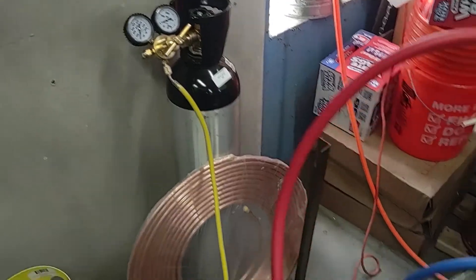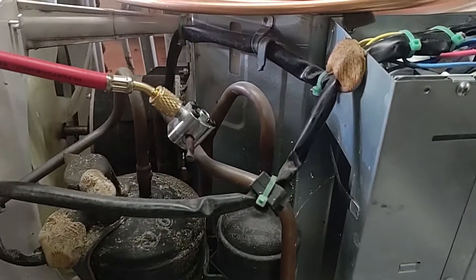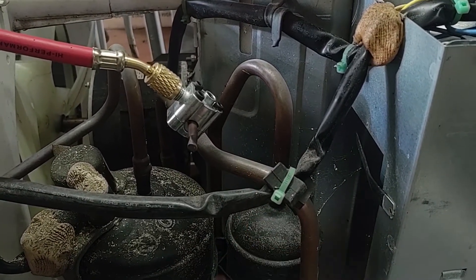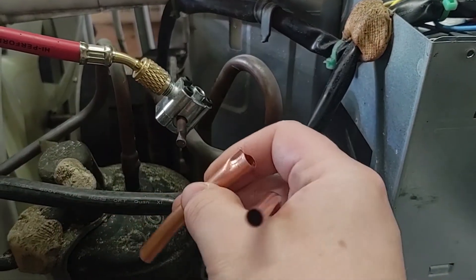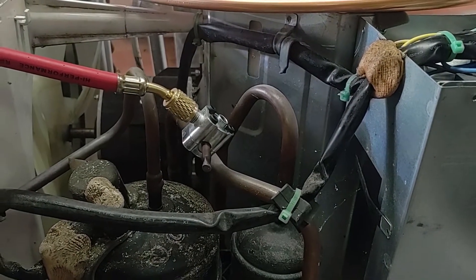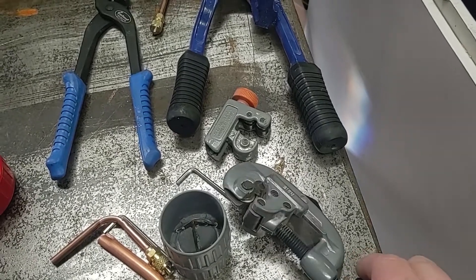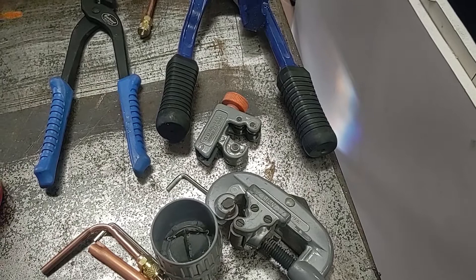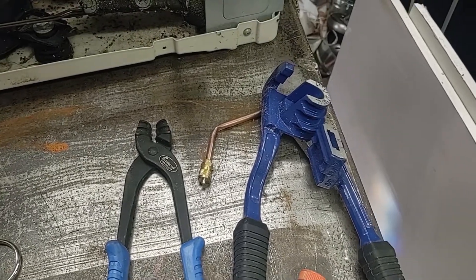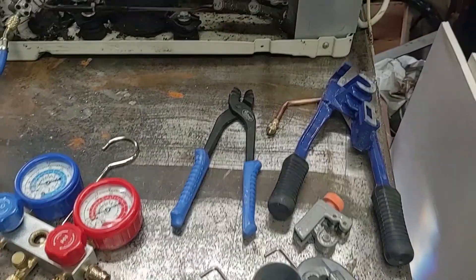I have my nitrogen tank hooked up now. I have about 20 pounds of nitrogen in the air conditioner. I'm going to take off the high side valve and replace it with the permanent valve. Unfortunately my stub here is almost the same exact diameter as my access valve, so I'm just going to use a larger piece of tubing as kind of an adapter to be able to solder that back in. For cutting the tubing I've been using these tubing cutters, trying to avoid getting any filings inside the tubing. To bend them I also have some brake line tools - that's what let me get my 90-degree angle on my valve. I'll toss all the tools and parts used in the description of this video.